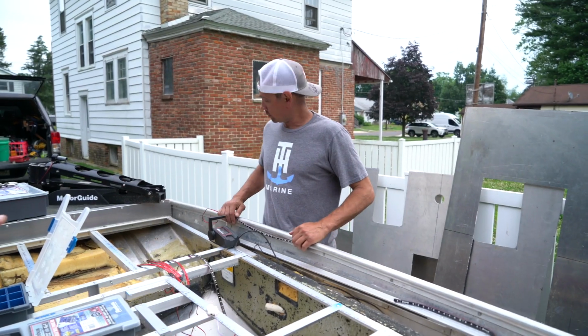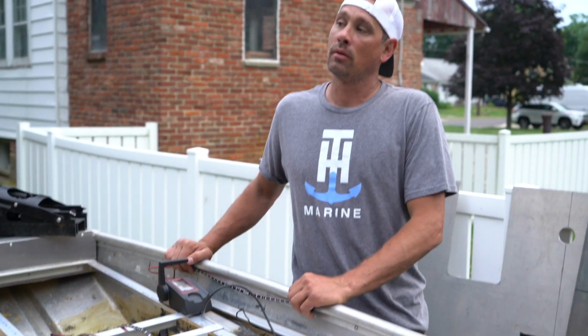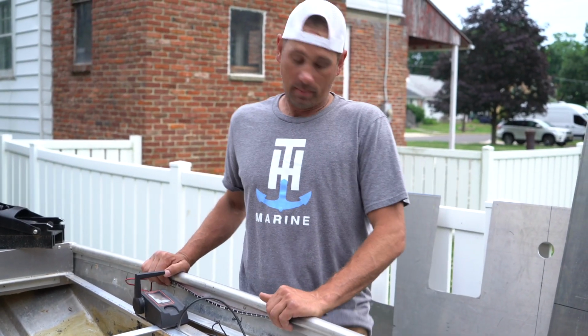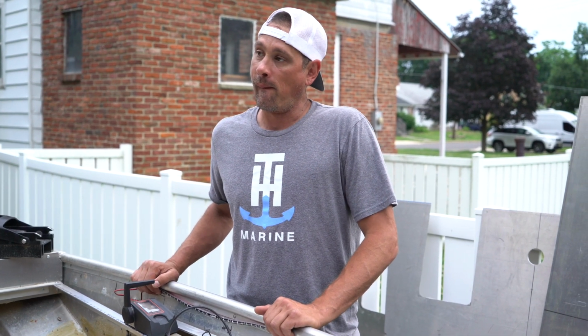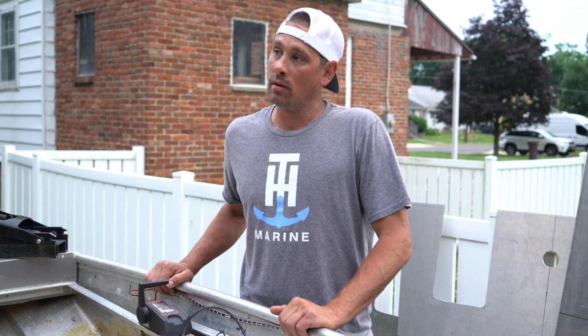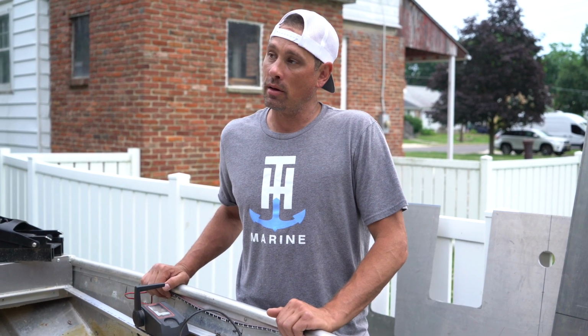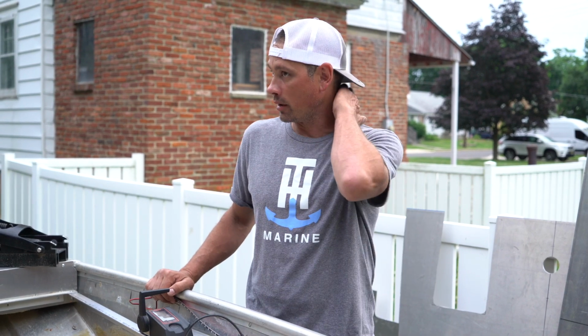Lumens. I wouldn't get it. You don't want it right up on you. If you turn them on and you're out at night, you don't want them right up on you. You want them a little behind you. I put most of them behind where the C post is, so they're not in your face. Because they blind you. They'll take away your night vision.